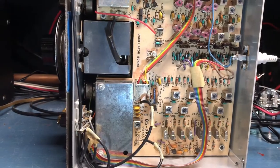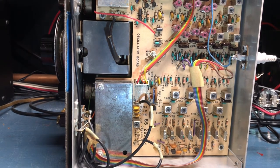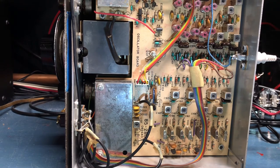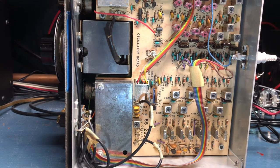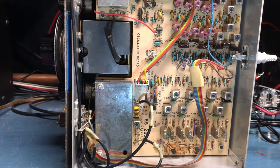Here we are with the top cover off. The controls are on the left, the back of the radio is on the right. This is where I picked up the RF — right here is test point 102. That's the VFO, which runs around 6 MHz with a 250 kHz range. I have a wire from test point 102 going down to the other side of the radio, which is the receive/transmit board.